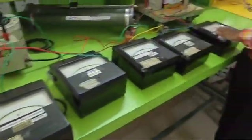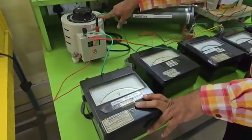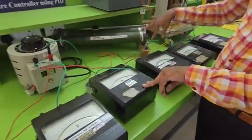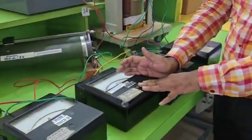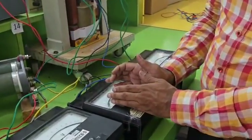So finally we have five meters in total. One voltmeter measures the voltage given by the variable auto transformer. The ammeter gives the current drawn by the RLC series circuit. Another voltmeter measures the voltage drop across the resistance. Another voltmeter measures the voltage drop across the inductance, and one measures the voltage drop across the capacitance.